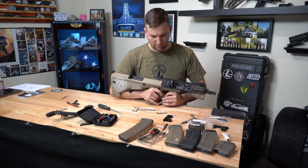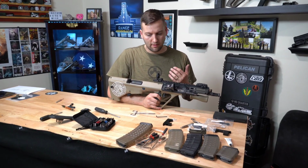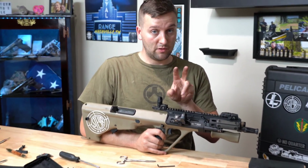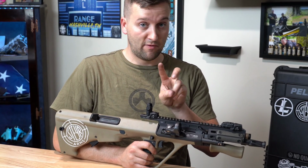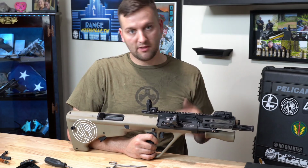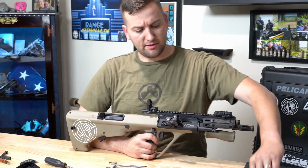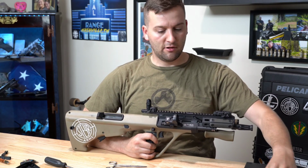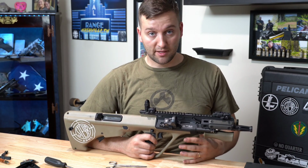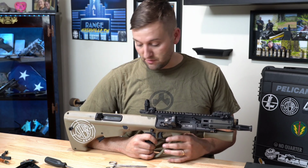So going back to the earlier video about the stock trigger components, knowing that we had mechanical flexing or bowing due to improper manufacturing or quality control with the linkage, we fixed that by shaving the ends to be the same. Having felt slop in the stock trigger because the tolerances were too wide, it flexed, it was spongy, it was bowy. This gets rid of those tolerances and tightens everything up.